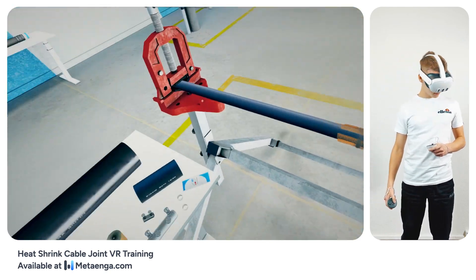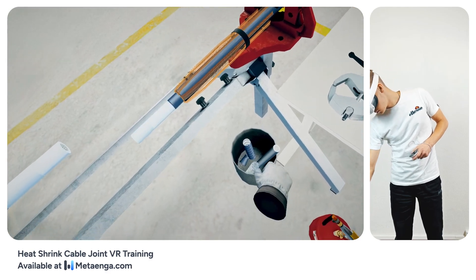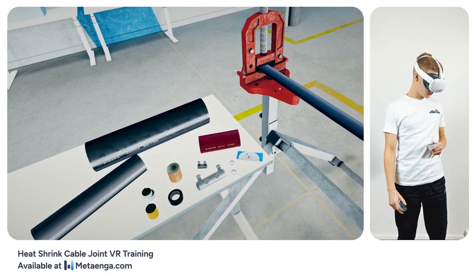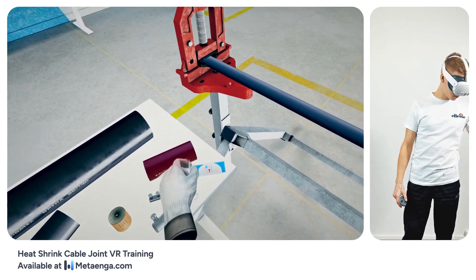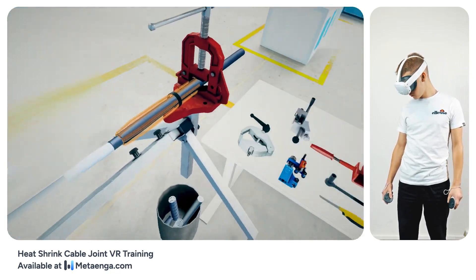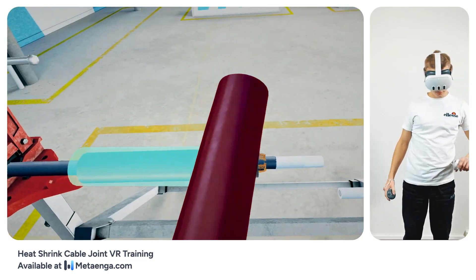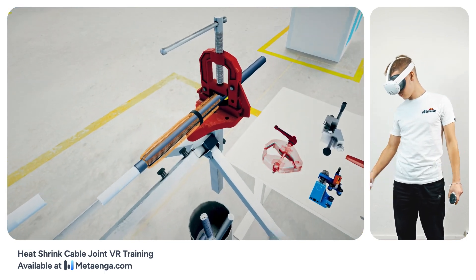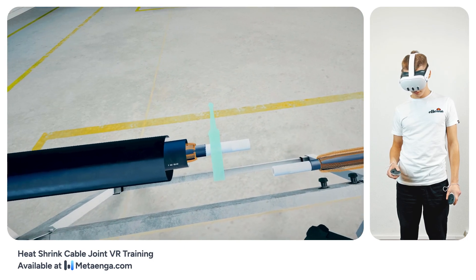Inspect the cable for any remnants of the semi-conductive layer clinging to the insulation. Now let's move on to the heat-shrinkable tubes. With the cables still separate, slide the conductive heat-shrinkable GCTH tube onto the left cable, then slide the three-layer GTTH heat-shrinkable tube onto the left cable, ensuring it sits comfortably. Next, position the external GPTHA heat-shrinkable tube, then begin fitting the QC2 tool stop at the desired depth in relation to the connector's length.